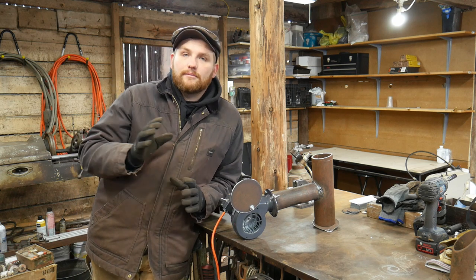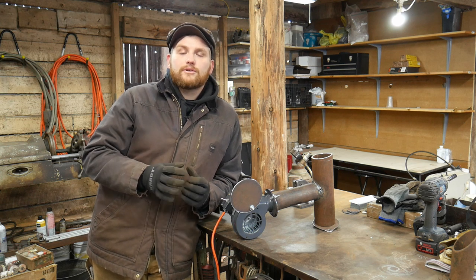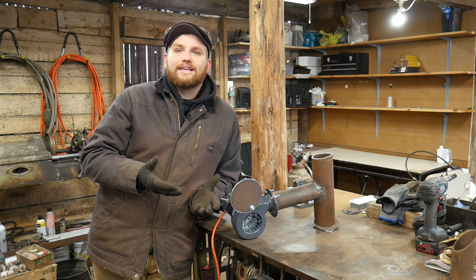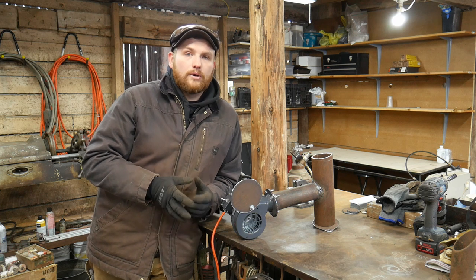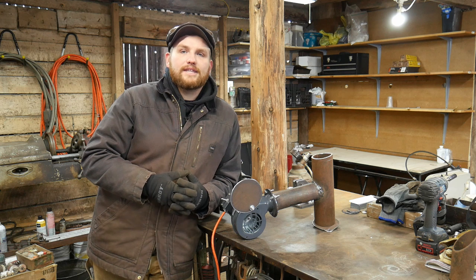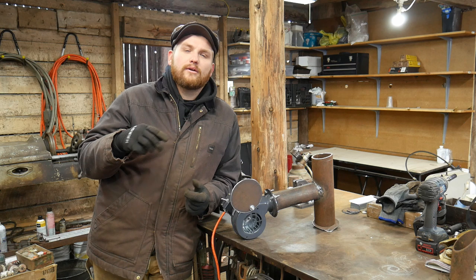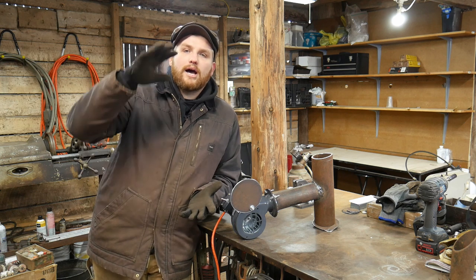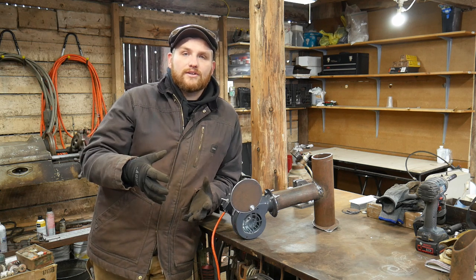The biggest thing that you need in a blower is you need to be able to develop static pressure. You need to be able to develop inches of water column. So that's, you know, the lift basically. You need to be able to develop pressure with a blower. Not all blowers do this. A lot of blowers, say like in a fan, squirrel cage and stuff like that, they don't provide a lot of static pressure. They basically move air kind of like a household fan, and that's just really not sufficient when you pile a bunch of coal or coke on top of it. That's not going to be very sufficient for you.